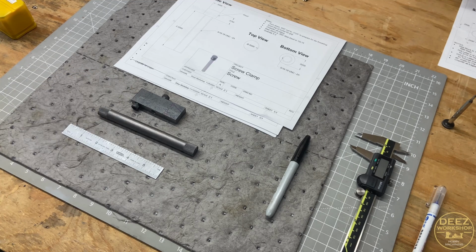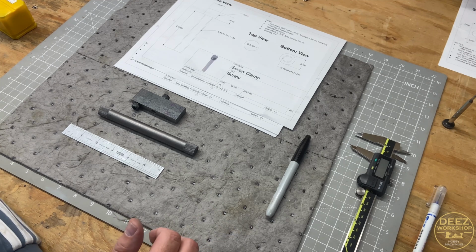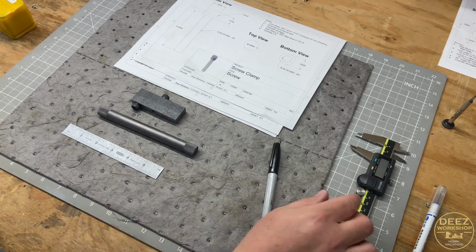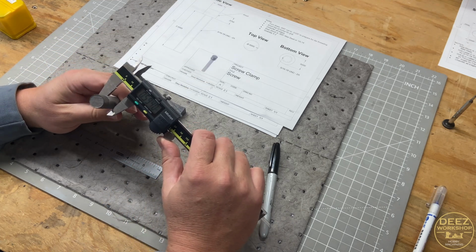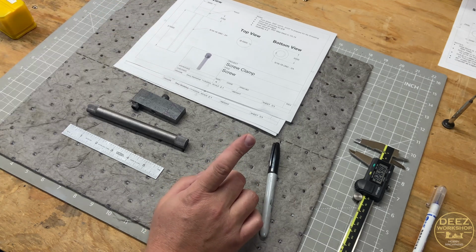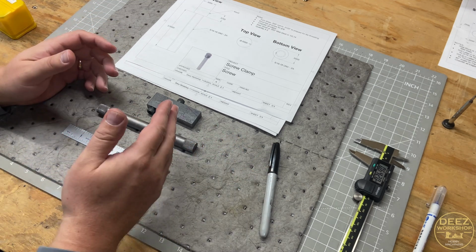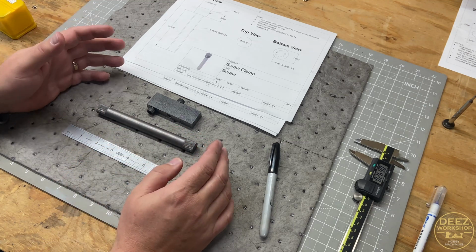In my haste, I've been talking about trying to do everything right and in the right order, and I just got excited to do knurling. I didn't stop and think and measure, and I remember now, this was 600 thou rod, 594. It's not 1/2 inch like I have in my drawing. However, there's one other problem that's bigger in my opinion, which is order of operations. I thought, well, I'll just do this because I don't want to clamp on threads, and how do you complete your piece when you won't have much to grip on?